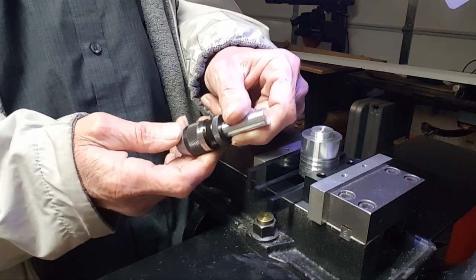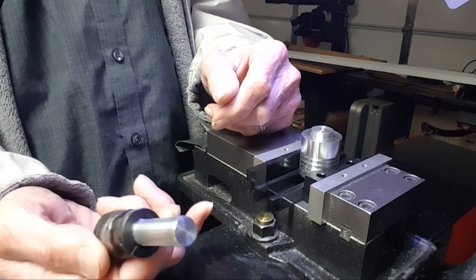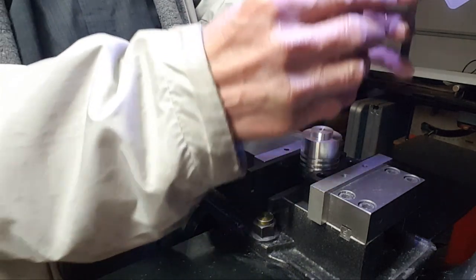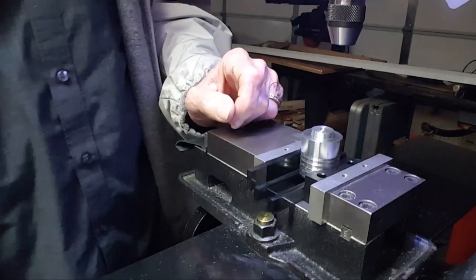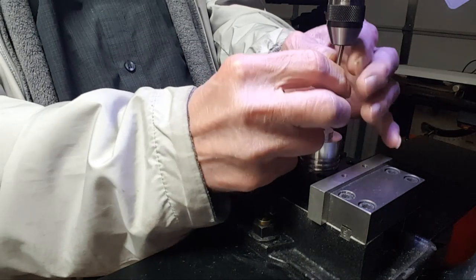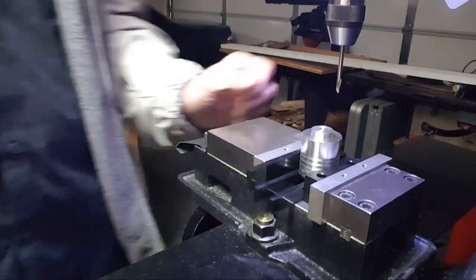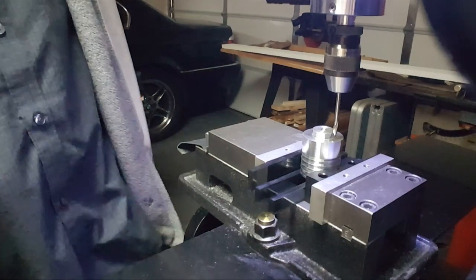Okay, so this is my, which one? Can't read it, no light. Precision check, Yom brick or something like that. So I like this guy a lot. Doesn't hold very big stuff. And I'm going to use my center drill here, because I don't want the drill bit to be walking. So that should look right. Yep, it does.